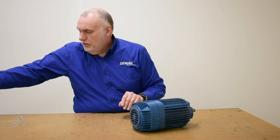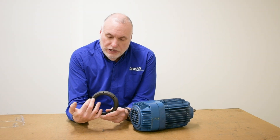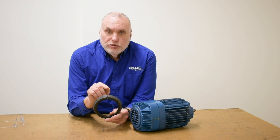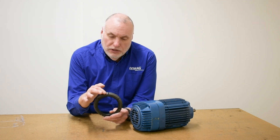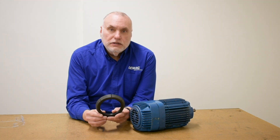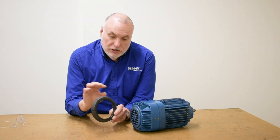Under this cover, we will find the brake ring. Brake rings have cleaning grooves, and you can see there's an inner ring and an outer part of the ring. The rule is there must be groove remaining. Also, you want to find a dull grayish color on the outside of the rubberized brake lining.